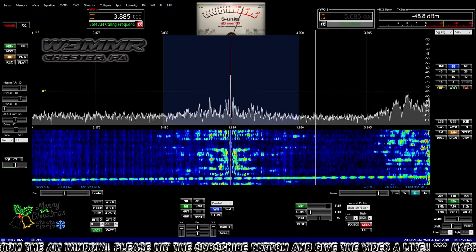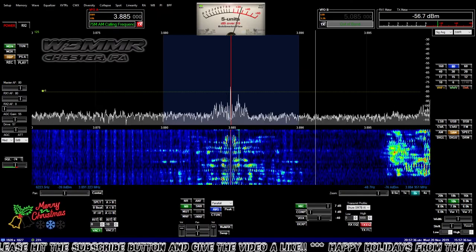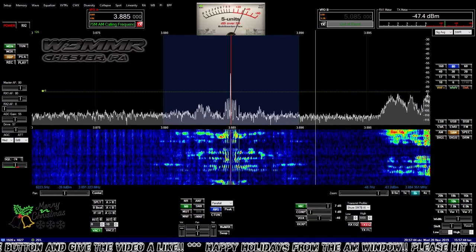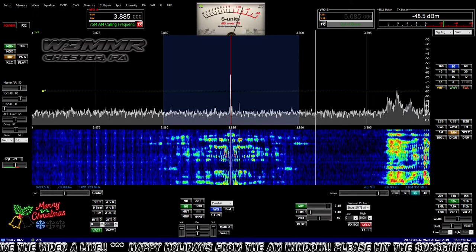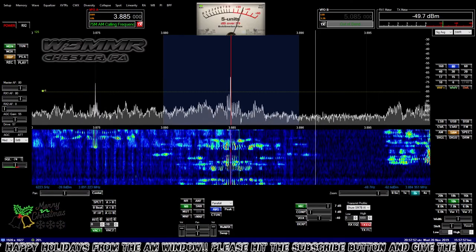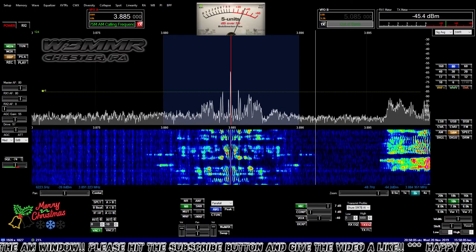Each coax coming down is RG11, all 75 ohms, with a half wave at 3850 and an additional 84-degree stub in series — approximately 52 feet in length. So the drops alone are 109-plus feet, meaning around 170 feet of coax on each dipole to the ground at the phasing box. The 71-degree line is the actual stub that steers the array — approximately 42 feet of RG11 that loops back into the box. The one key factor is a full wave to get to the house at 3850 kilohertz, tuned dead on, so you're looking at the input impedance to the phasing box.